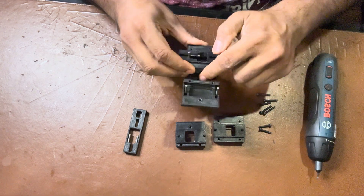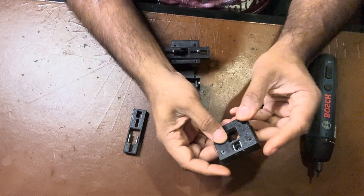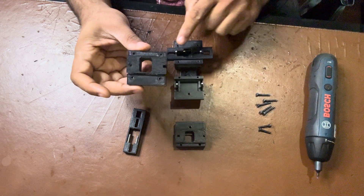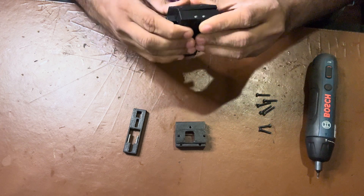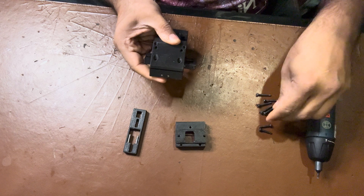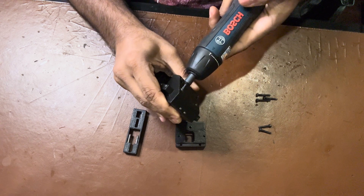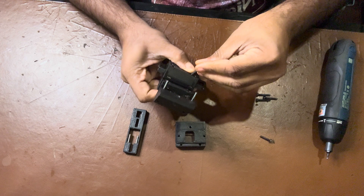So we assemble it like this. This is the top part of the tool body. We need to take the tool body which has just two dowel pins — a single part — and align these holes with the dowel pins. We align them like this and push it forward, making sure it can move freely. There are two M3 by 16 Allen screws required on this side, and two M3 by 12s required on the other side.